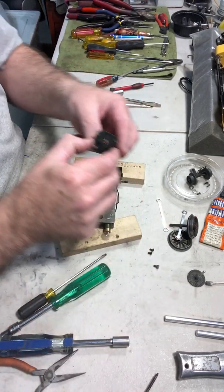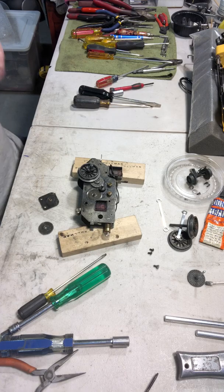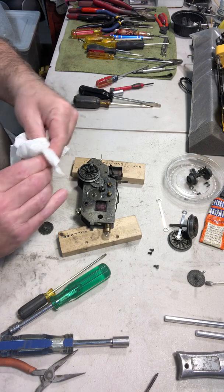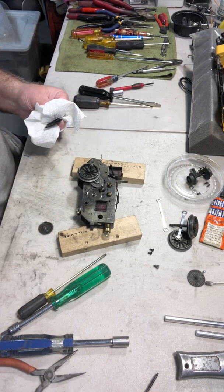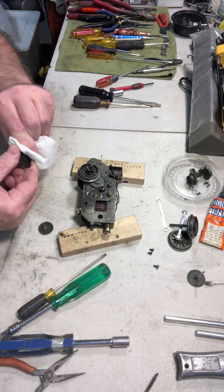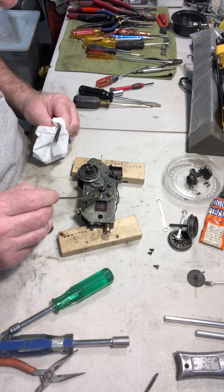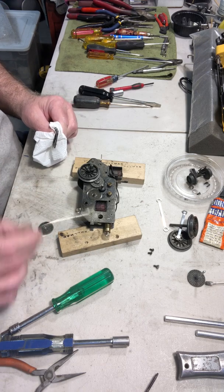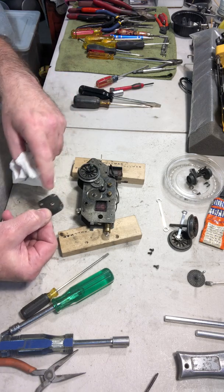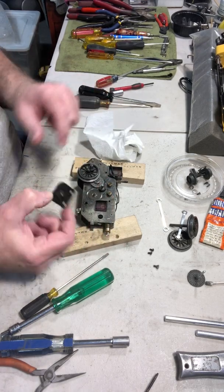The back side of the plate, as you can see, I'm going to wipe some of this goo off of here. I got some paper towels here. Looks like some kind of a hairy beast was run over by this thing, and a clump of hair and grease came out. But that's what happened over time. You can see there's actually something pressing down on this gear enough to scar the frame, and it actually has worn the corners of this plate. So riding with this spinning, the gears now are actually rubbing up against the plate.